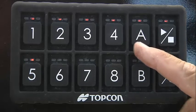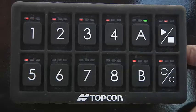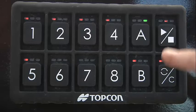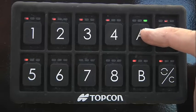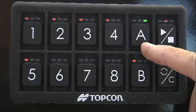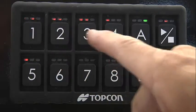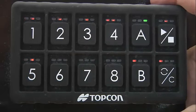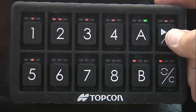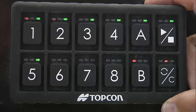To enter calibration from here, hold button A for about a count of five and release it. It should turn green, indicating you're in calibration. You should verify this on the monitor as well. Now we have to select the tanks we wish to calibrate. For this example we're going to select them all. No need to have product in to do the functional test. Now we can hit our master — counting RPM, counting pounds of expected product — and verify this on the monitor.